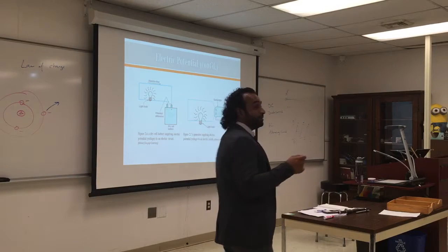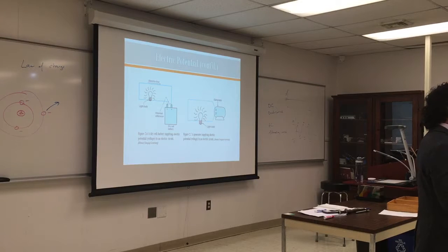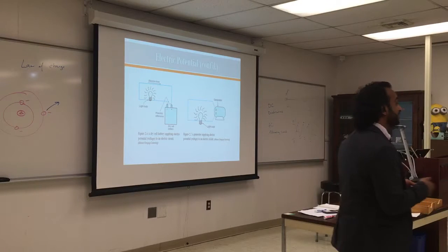Okay? Again, if you put your multimeter on DC, I'll show you how this happens. Put it in DC and put it onto the receptacle, what are you going to see? A very quick change between minus 120, plus 120. It's going to flicker, minus, plus, 60 times, because it's trying to read DC, but it's getting AC.